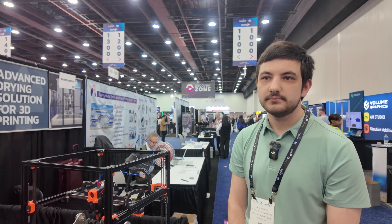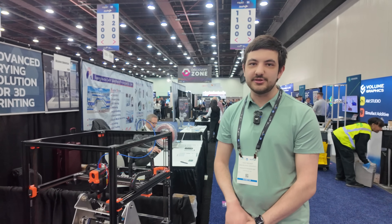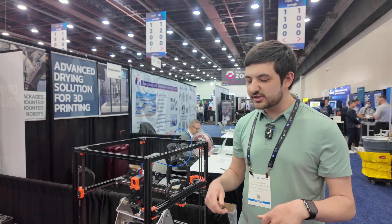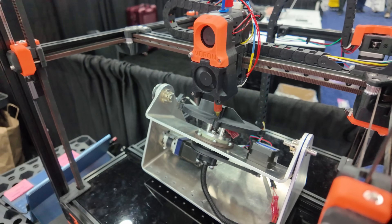That's been the biggest problem holding back 5-axis 3D printing, at least at the consumer level. Absolutely — 5-axis has been around for decades with CNC. There's no real slicers or turnkey easy solution for an at-home user to use a 5-axis system on a traditional 3D printer right now. Hopefully one day the software gets there. In CNC, people are used to a lot more manual toolpath planning — even a 5-axis CNC, programming that is very intensive. Whereas with additive software, we're not used to having to manually drag toolpaths around. You click a button and it goes — throw the benchy on the plate, hit slice, and off you go. Once we can get there, it's going to be a lot easier and more justifiable for established companies to build these 5-axis machines, because they don't want to put the money into building an entire slicing package. But once it's there, you'll see a lot more machines on the market.